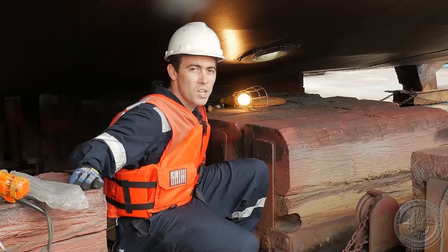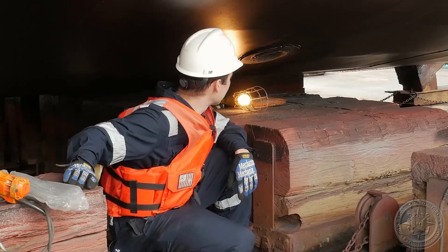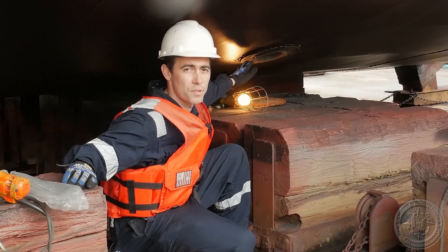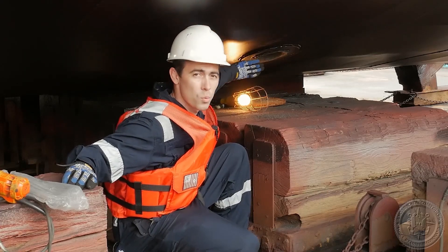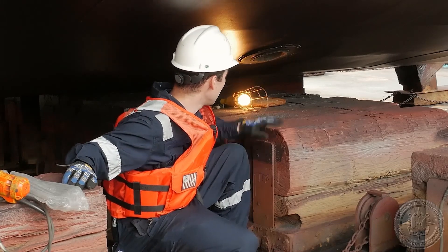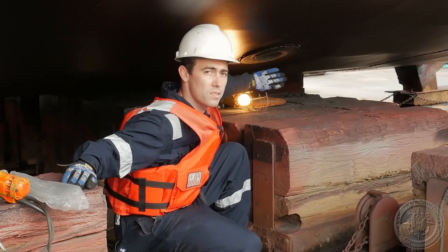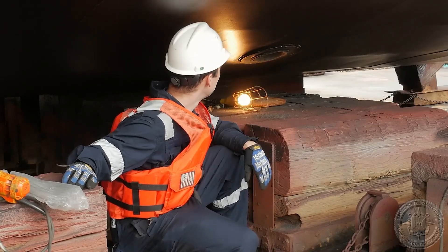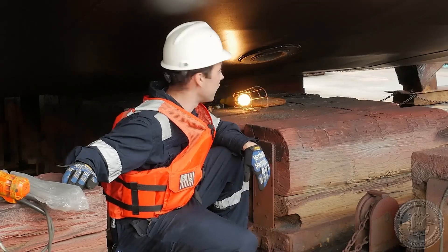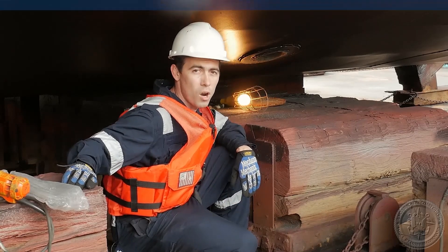Let's take a moment to talk about the transducer here. Right here is where the transducer is attached to the pole. The biggest thing we're looking for is signs of corrosion and wear. Right at this point, they're actually working on this transducer, doing some welding on the doubler. When this dry dock work is all done, they're going to make sure the transducer is back in place, sealed up, and ready to go. All we're looking for again is signs of corrosion, wear, and that when the transducer is put back in place, it's put in properly and sealed up for watertight integrity.